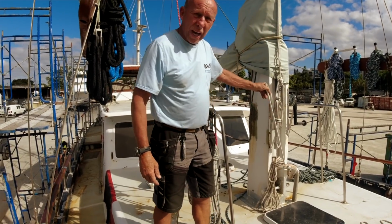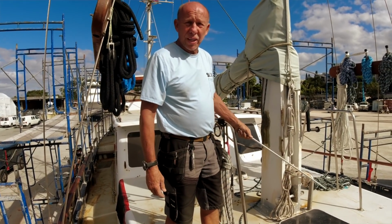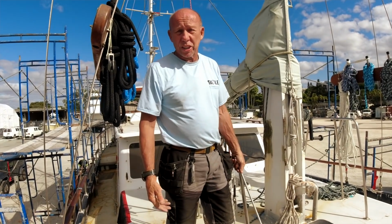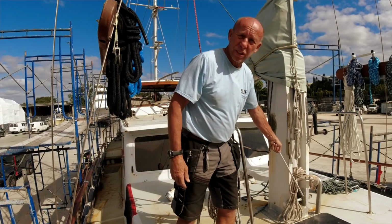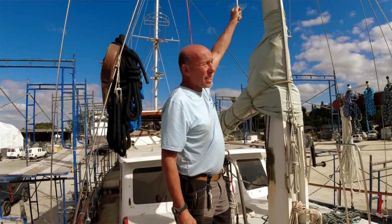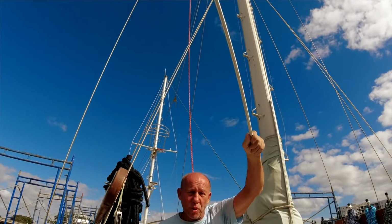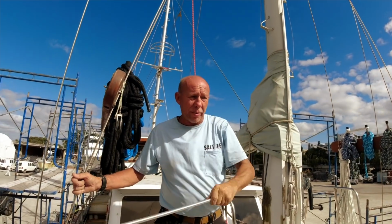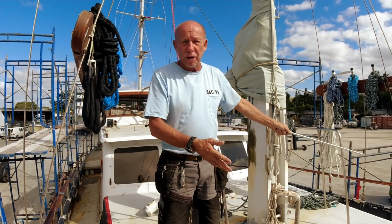There's also a boom that we have in the shop that is good for 6,000 pounds. That boom connects at the lower portion of this tabernacle mount. It extends up 14 feet. It allows us to go starboard or port and pick up anything from engines to heavy gear to equipment, so we can put that on the upper deck.